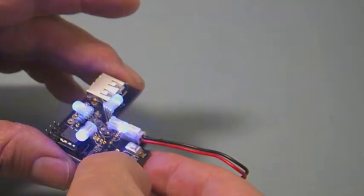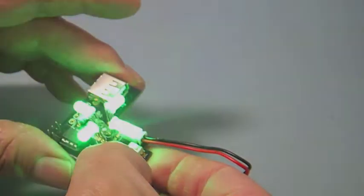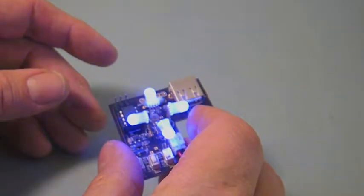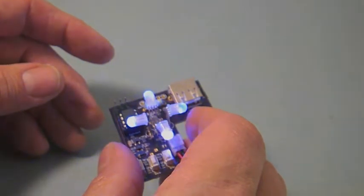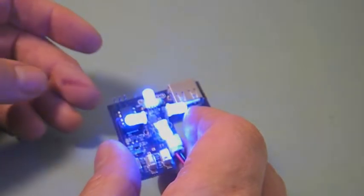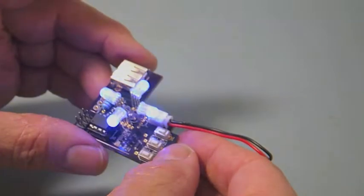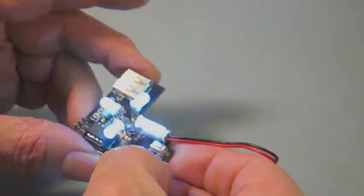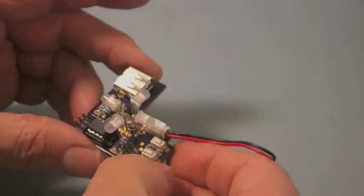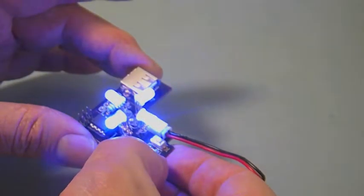So let's say we want to save that. What we do is hold down the select button and watch for the two green flashes. Now, even after I reboot the circuit, that new behavior is programmed in. It is now being loaded off of the PROM, so it will sustain for forever. Well, for as long as the chip works. As long as we're playing with this, yes, might be wise to turn down the sensitivity a little, but in any case.